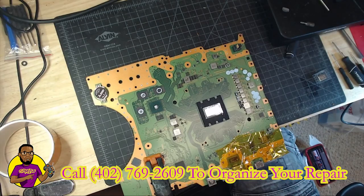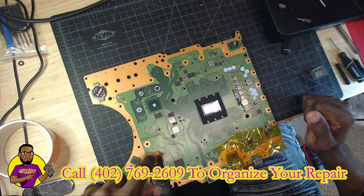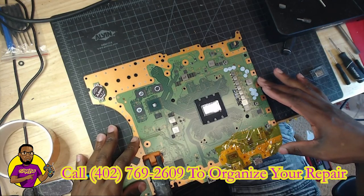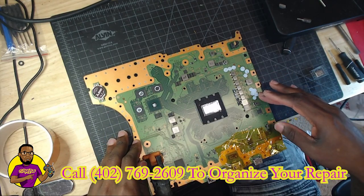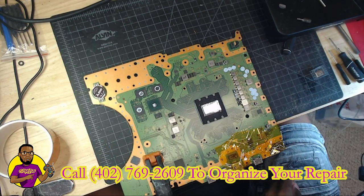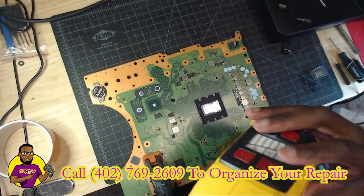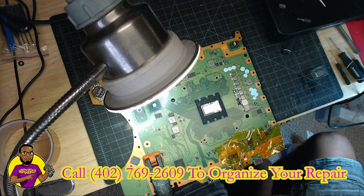The best clamping point will be right here — there's a screw hole here and a screw hole right under this clamp. I clamped it right here. I don't feel comfortable putting a clamp over on this side because it can bend and warp this board, especially when applying heat. You could possibly pop a chip or tear up one of the chips from heat getting to this motherboard. I'm going to take my heat gun — this is a Wagner regular standard heat gun you can get from Home Depot. Before we even turn on the heat gun, we're going to turn on our fume extractor.